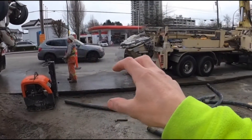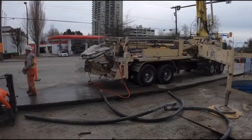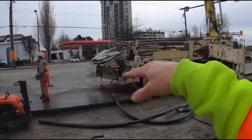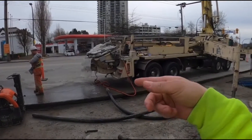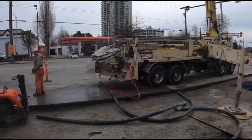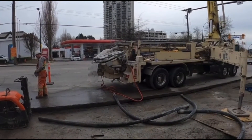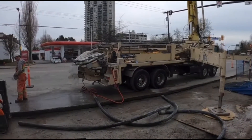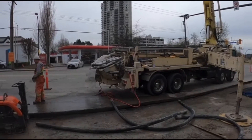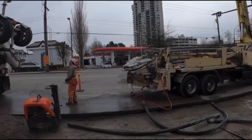Once we suck back the sugar and water through the elbow in front of our sponge, it'll take care of all that stuff. So we'll end up with a hopper full of concrete that's not going to set for days. When we're done here I'll flip the lid up, take a sample of the concrete from the hopper, put it in a glad bag, and take it home as my little pet project. I'm going to check on it in a couple days and see if it's hard or not - I would bet lots of money that it's not going to be, and even if it does hydrate somewhat, it will have zero strength to the point where you can just crumble it with your hands.